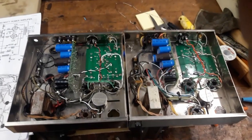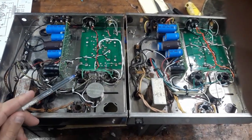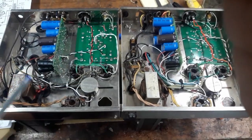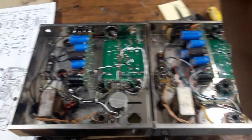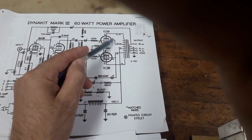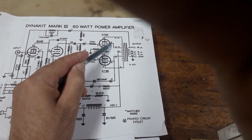In the morning, the time that these thoughts occur, I was going over these schematics, and I realized that earlier I had discovered that this amp, both of them, had been triode connected, not ultralinear mode, which is the whole high power mode. Ultralinear mode on the schematics is when these taps of the output transformer on the primary are connected to the screens, which are always pins 4.